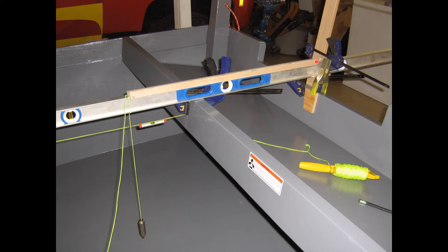So 30.54 inches forward, I dropped a plumb bob off our level down to the bottom of the boat, and I looked where it hit our string line and made a mark on this horizontal string line with a Sharpie. That is our first station in front of the transom. The remaining stations are easy to measure. You just take the tick stick, put the aft end on that mark, and mark the forward end, and continue all the way to the bow.